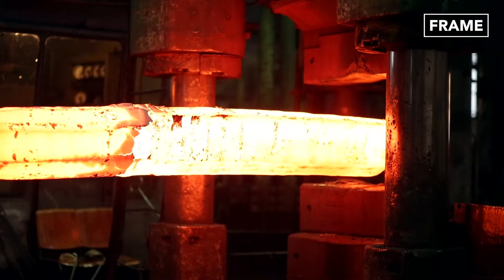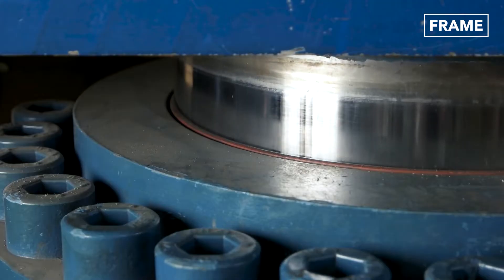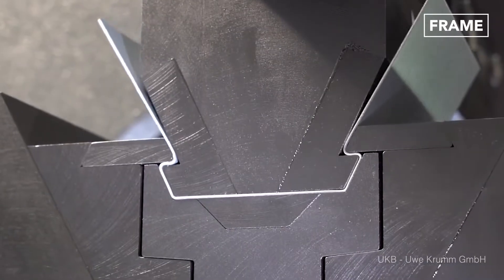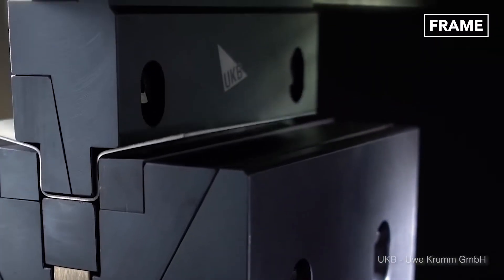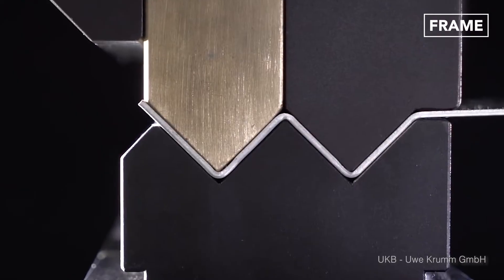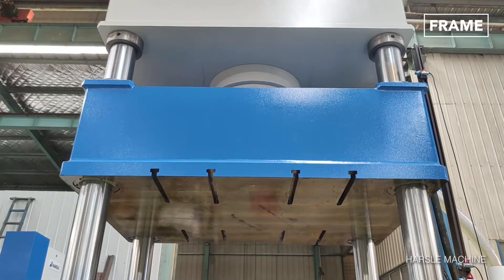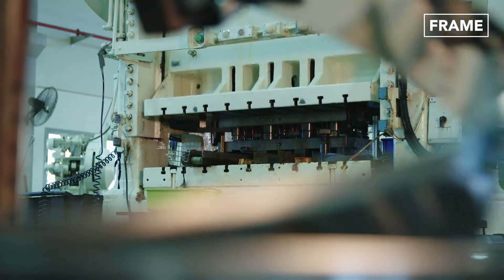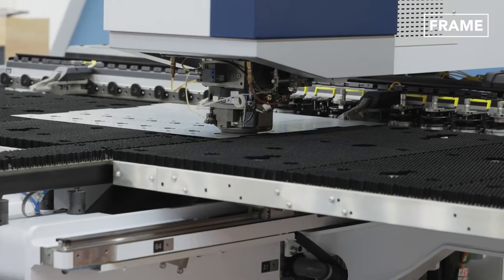One of the most advanced processes is what's known as cold forming, with no heat applied. With cold forming, metals are stressed using powerful hydraulic presses which exert hundreds of tons of pressure, deforming the metal's crystalline structure and compressing it into a stronger and denser piece of material. Though it may look easy enough, cold forming is actually a very complex process. Rather than apply cooling to the metal, the term only refers to the absence of heat, as metal materials are forged at near room temperature.